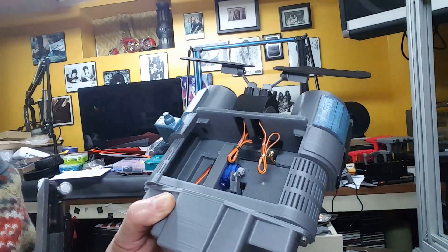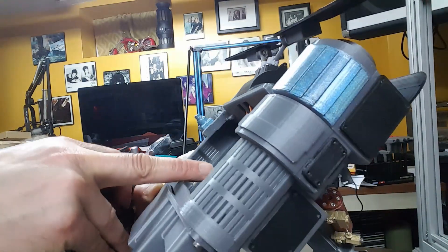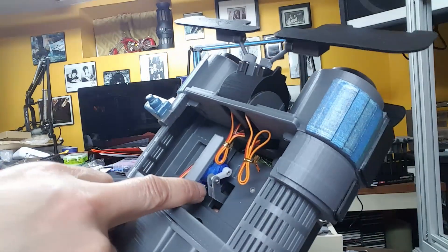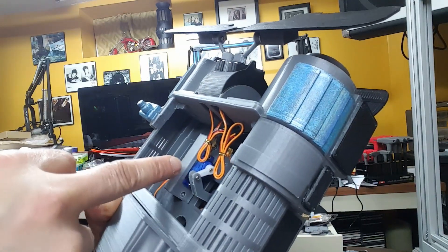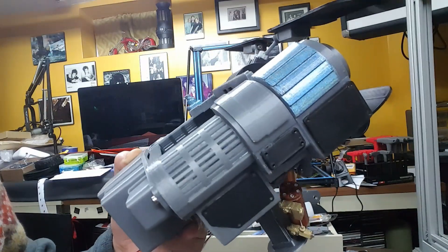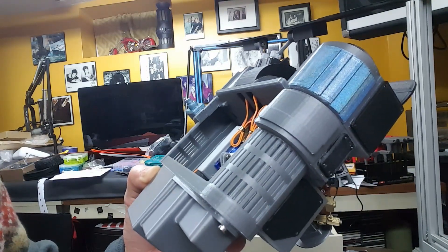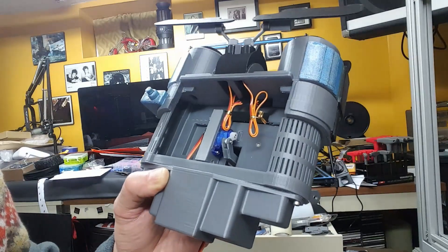You can see the two cables to the servo. I made a custom bracket for the motor because now that this is larger the screws will not mount where they go. I had to make a bracket and center the motor so that the head can tilt freely and the motor can handle it. I've tested it and amazingly enough, even though the head is heavy, this thing can move it — so I'm pretty stoked about that.